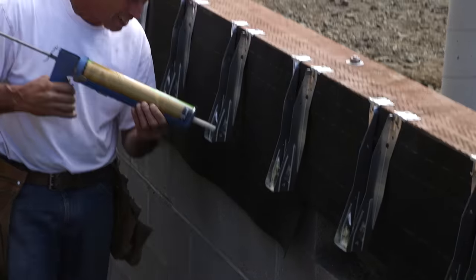Reducing squeaks is a real motive for using the wooden I-beams. There's a reason that they are referred to as a silent floor. Two or three differences between manufactured floor joists and sawn, that is full sawn, 2x12, 2x10, real dimensional lumber floor systems. These will never shrink. You're not going to have them losing dimension over time and leaving part of the floor at a post or a different bearing condition high, creating the opportunity for a squeak. They also are exactly the same depth.